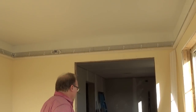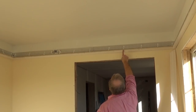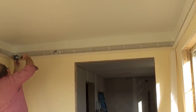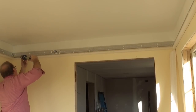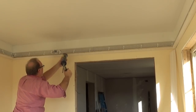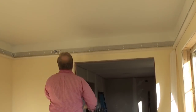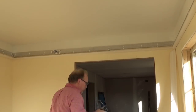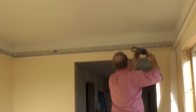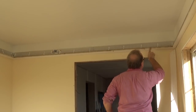See that white up there — what I did is about every eight to ten inches I ran a bead of white silicone adhesive over the two strips down across the reflector. The idea is to give it additional bonding so that if the strips do come loose they can't completely fall off the reflector. Now I'm using PL premium urethane construction adhesive and I'll put that on before I put the first piece of cove molding on. I like the PL premium — it's kind of messy to work with but it gives a really strong bond and helps fill gaps.